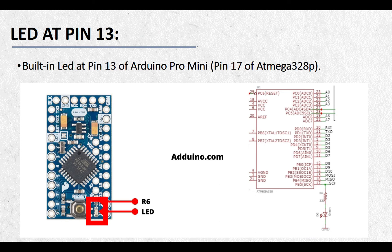There is a built-in LED connected to pin 13 of the Arduino Pro Mini board, which is also the serial clock pin for the SPI module. It will blink when the Arduino Pro Mini is communicated using the SPI protocol and also when you are uploading a sketch onto the Arduino Pro Mini when connected to an SPI programmer. AREF is the analog reference pin of the ATmega328P, and we will discuss its use in an upcoming lecture. A capacitor C1 of 0.1uF is connected there to reduce noise on the AREF pin.